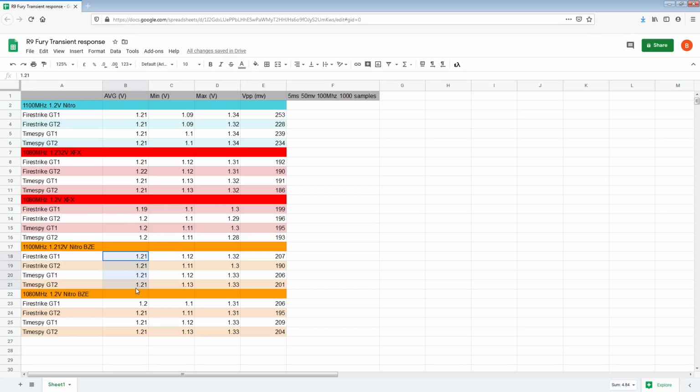So this is matched average voltage, and this is matched set voltage. What's really interesting is that the voltage is not entirely consistent across all tests, but again, the scope rounds across a 1 millivolt difference, right? So if the difference between these two voltages was really borderline, where you could consider them the same thing, the scope's actually going to make that look like a 10 millivolt difference, because it's rounding up or down depending on where exactly your last millivolt ends up. And that's really, really annoying.